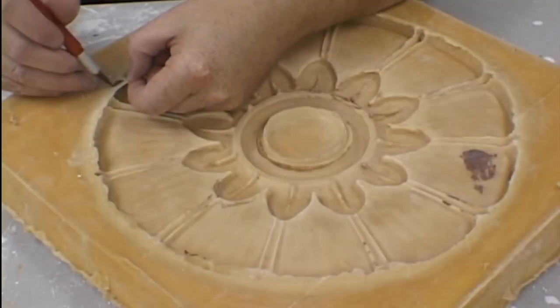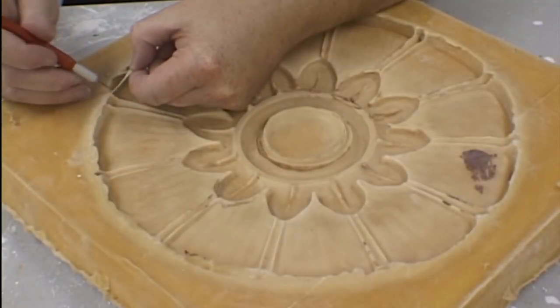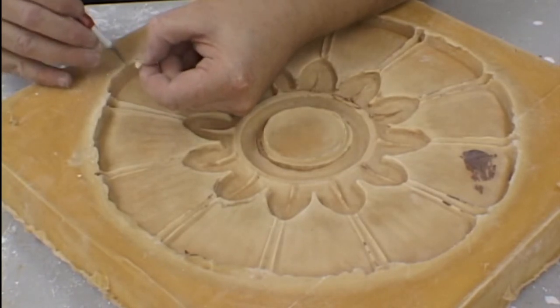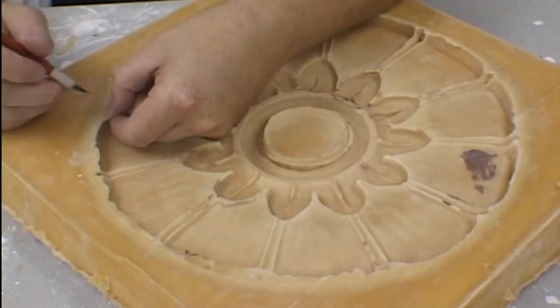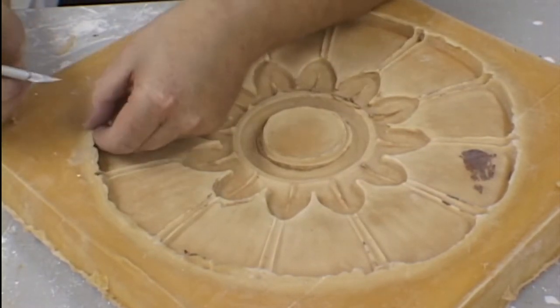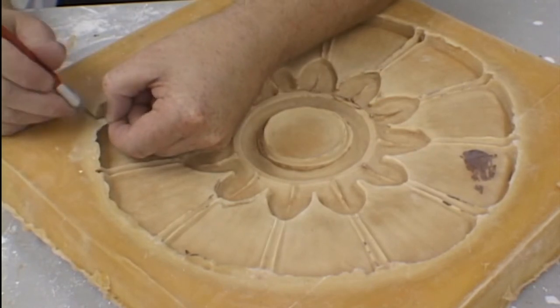Our final step in getting our mold rubber ready for use is to trim away any of the excess rubber that slipped underneath during the mold making process. Use a sharp X-Acto blade for this, work slowly. As you stretch out the strips of latex away from the actual mold, it will cut very easily.